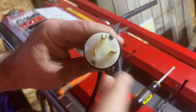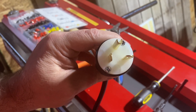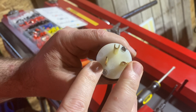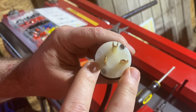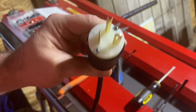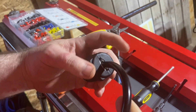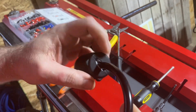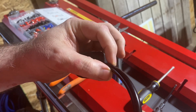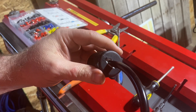That also means that if you've got wiring that can only serve 110 volts, you shouldn't be putting an outlet on that wiring that deceptively communicates that the wiring is beefier than it is. The final point: when you go to clamp the back down onto the cord, be sure that those clamps are biting onto the external sheathing — the external insulation — as opposed to just the wires inside of it.